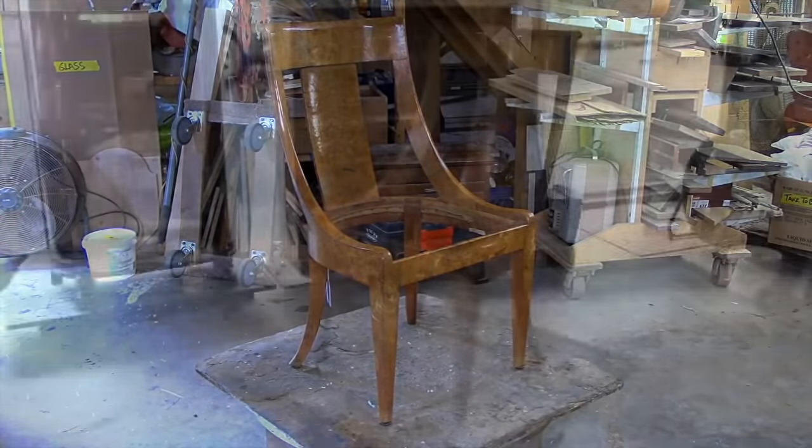I did keep the heat up last night. It's dried fine, but it is better than last time. I will say that. But this is what I'm going to do. I'm going to sand it again with 220. Try to sand it level without going through. Then I'm going to wash it again the same way I did last time.